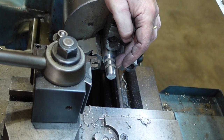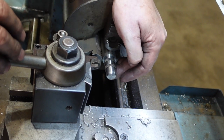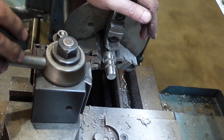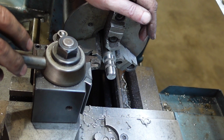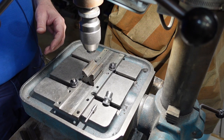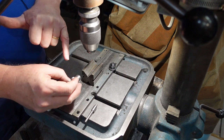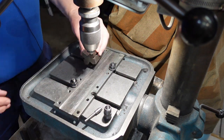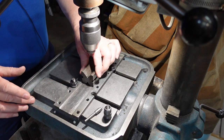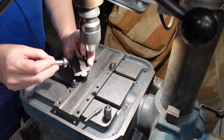I'm now doing the handle that goes over the top. As I normally do, I'm leaving the internal detail until I put the outside knurl on. Because it's a straight knurl you basically have to push into it - it's not a nice thing to do for a small lathe, it plays havoc with bearings apparently. This is once again scaled off the picture I have of the handle. This is the setup I have for getting holes into cylindrical items on the center line - it's basically a couple of V-blocks in a shallow tray that allows them to slide back and forth.